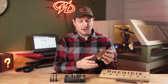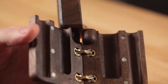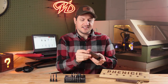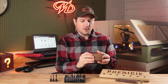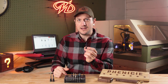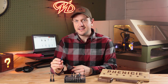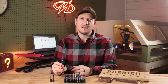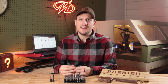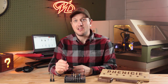I wanted to make this as an excuse to use these barrel hinges. There's a hinge at the top, but it also opens up like a book and you get these two hinges laid inside of it. To get these to the right height so that the barrel hinges were the right size, I had to clear off a lot of material off the top of the walnut, and for that I used this two-flute down-cut bit. This one is blue in color, which within this line of end mills indicates it has the nano coating technology — a ceramic coating — and much like the ZRN armor, it helps it stay sharp longer and just last longer in general.